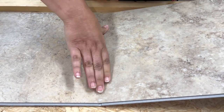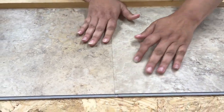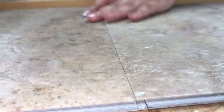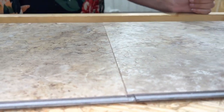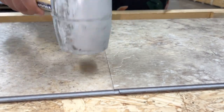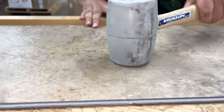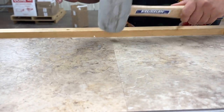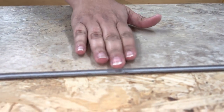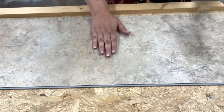This tile is a little bit finicky, but it will get there. Right now I still have a raised edge here, but you're gonna be able to take your rubber mallet and get this shut. You can check it, feel it, and it's smooth. That is the successful end-to-end joint locking.